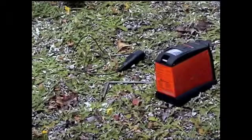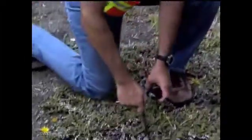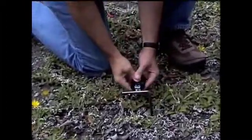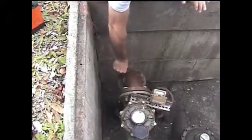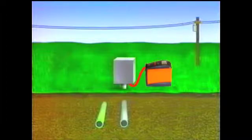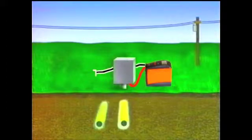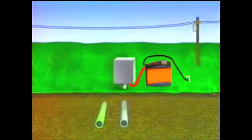The next step is to ground the transmitter. If no existing ground is available, use the ground spike. Extend the black lead of the direct connect cable as far as possible from the transmitter, and at a right angle to your target conductor. Drive the ground spike into the ground, then clip the lead onto the ground spike. Next, attach the red clip to the most convenient hookup for your industry. Make sure that you have good metal-to-metal contact. The better the contact, the better your signal. Make sure that the ground wire does not lay across or too close to another buried conductor. This may cause the signal to return on an unwanted conductor or create signals that make it difficult to isolate your target. If this happens, move the rod or plate to another location, away from the unwanted conductor. Although this may reduce the signal strength, it will help isolate the target.